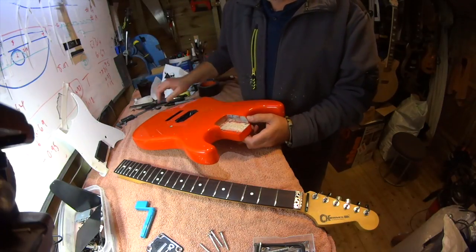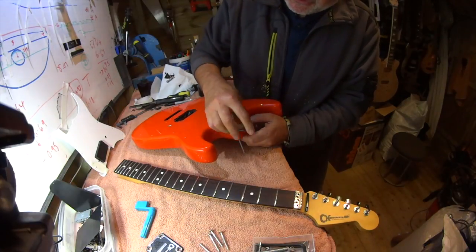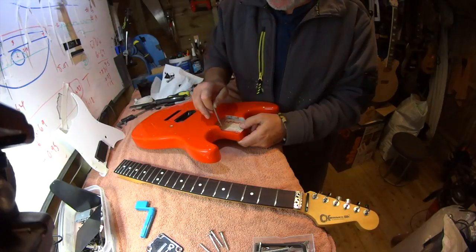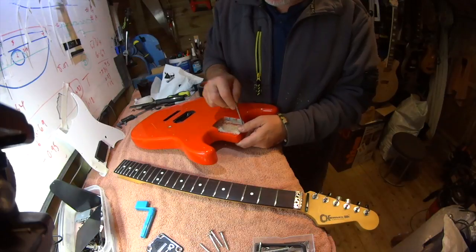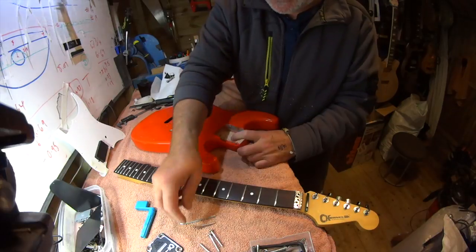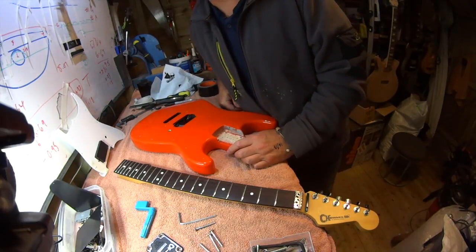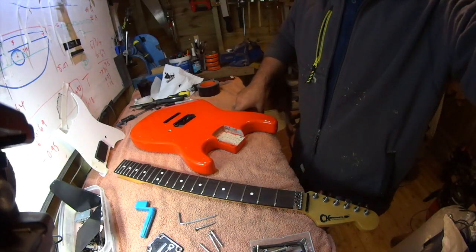One of the things I've learned over time is that you want this to be slightly bigger, so that it's just a channel for the screws. You don't want the screws pulling on that. You'd much rather they travel through there and exert their force on that, for which of course those have to be good condition holes. But again, it depends. These are obviously just about the right size, so I might want to go a little larger than this. And I don't want to ream that, because the reamer is too tapered. Where did I put it? It should be sticking out somewhere.